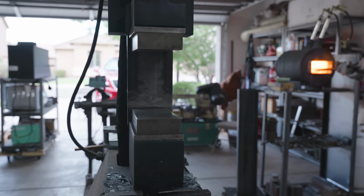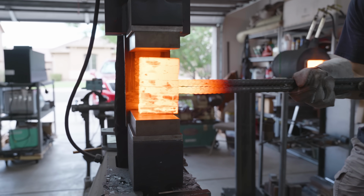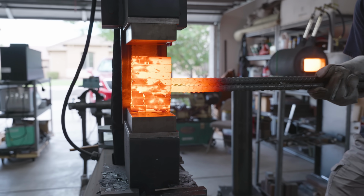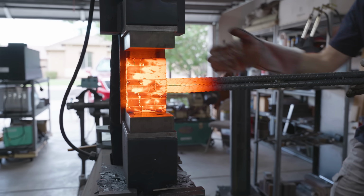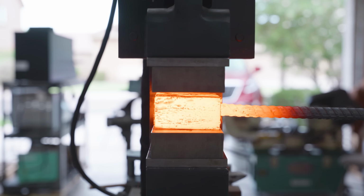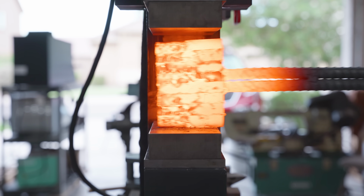A lot of new bladesmiths don't use the best quench tanks for their quench oil. I see a lot of bladesmiths using stuff like PVC tubes or like 5-gallon buckets from Home Depot, but those are really dangerous to use, and if you have anything bad happen, you're gonna have a bunch of hot oil spilling around in your shop. I highly recommend that if you have a welder and access to a steel supplier, you just make your own with a metal pipe and a steel plate.